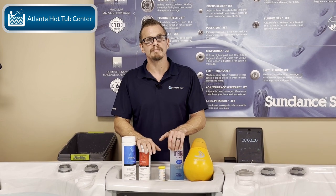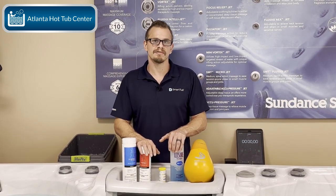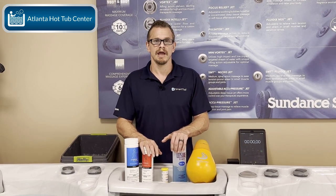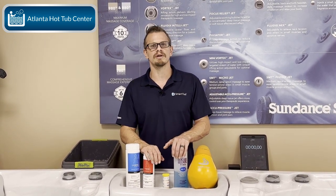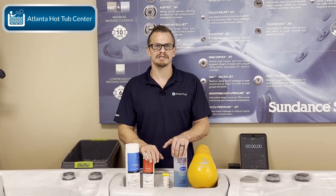Okay, pH up, sodium bicarbonate, guys. You have to have your pH levels in the ideal range to get a proper reading on the test strip. If your pH isn't right, your At Ease system's not going to work properly. You're never going to get your chemicals right. You'll never get your chlorine right. You've got to keep your pH in the ideal range. That's what this is for.